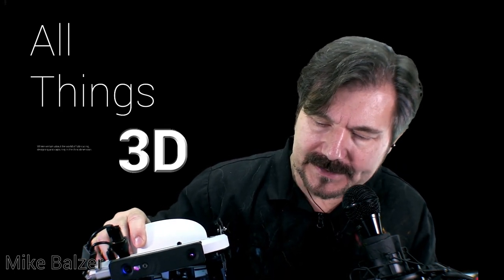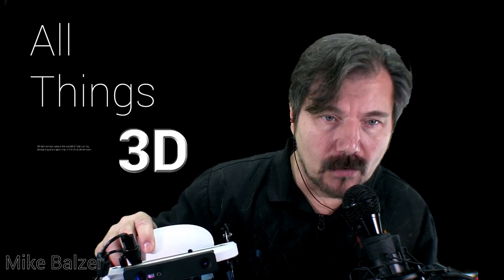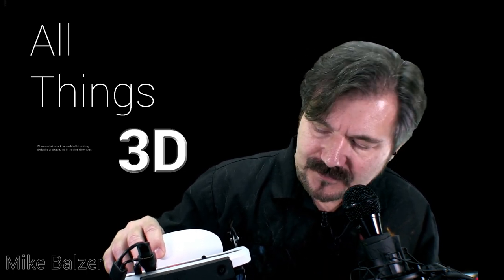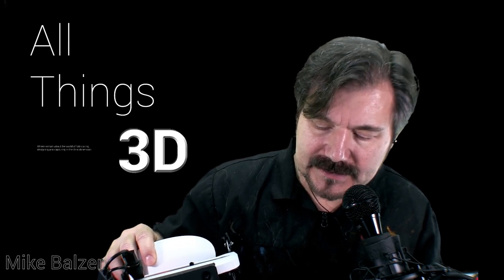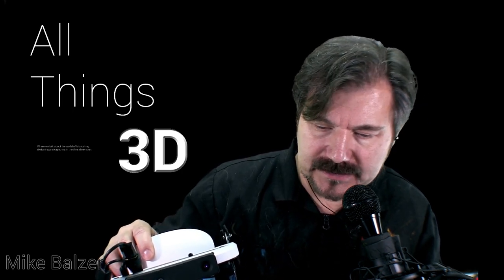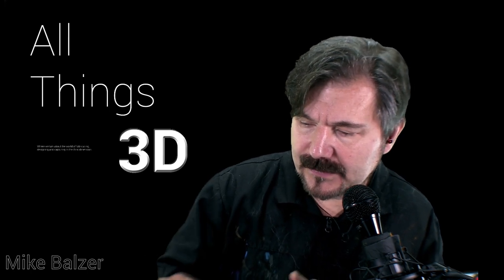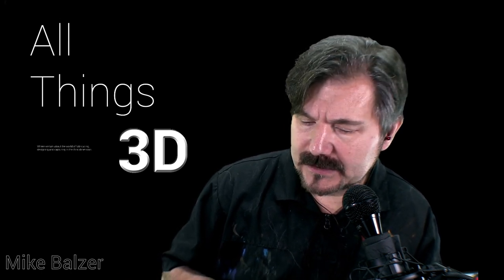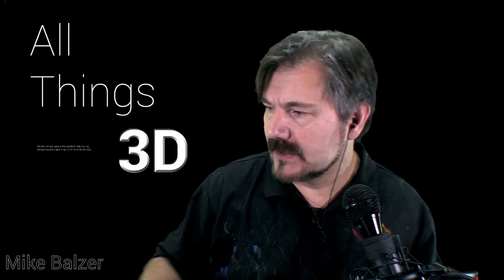I don't think they had thought about it from an AR perspective. But as you saw in the previous two videos, I think it works fairly well. The only disappointment is that the backlighting, since it's an IPS LCD, gives you kind of a gray instead of a full black. Clearly an AMOLED screen would be superior. But for the cost — about $100 for this panel — that is one of the disadvantages you could probably live with. If you've got an old DK2 from Oculus, tear it apart, because there's a nice 1080p AMOLED screen in that which could be used, and it also has an IMU.